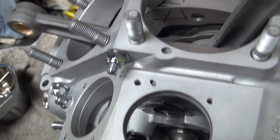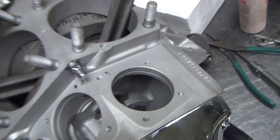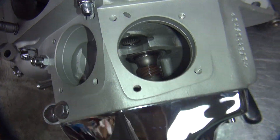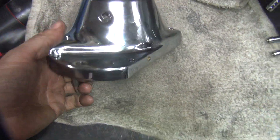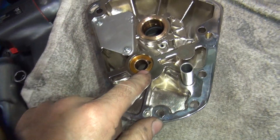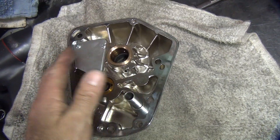All right, back trying to figure out the problems on this thing - why it's sticking. Looks like I found a problem. Right now without the cam in here, just with the pinion shaft, it's turning fairly freely. This here is a Midwest cam cover and this is a Mid-USA cam cover. Even though they look similar from the outside, they are different - they have different bushings. This one has a very bright yellow bushing, this has a more bronze color bushing, so it's a different manufacturer. The alignment of the shaft to the case is wrong. I tried the other cover on Fred's, and his was the same thing - it was another Mid-USA cover with the identical problem, it didn't want to go on.